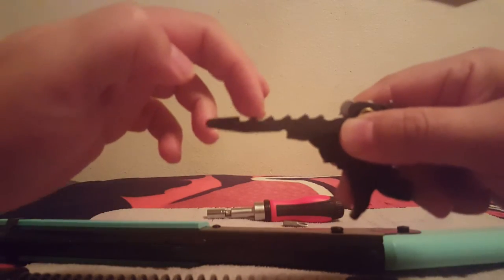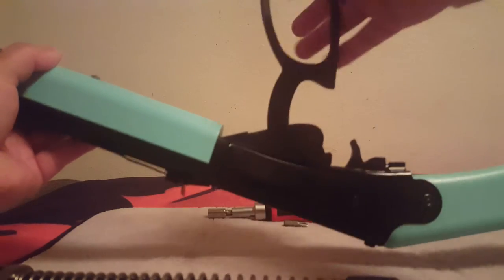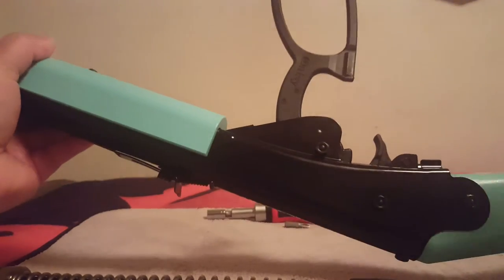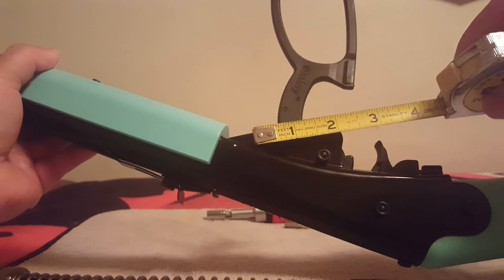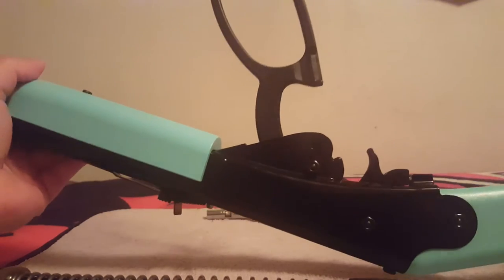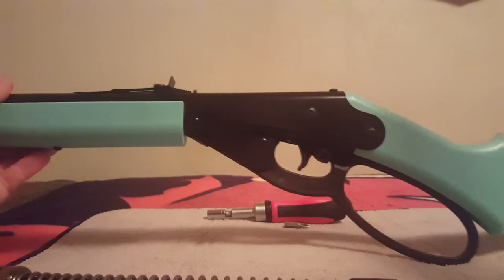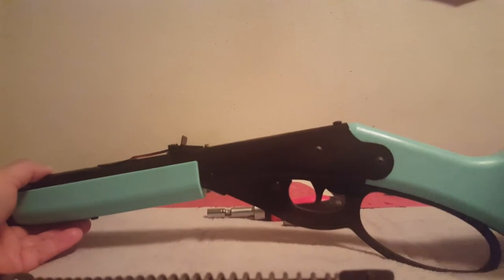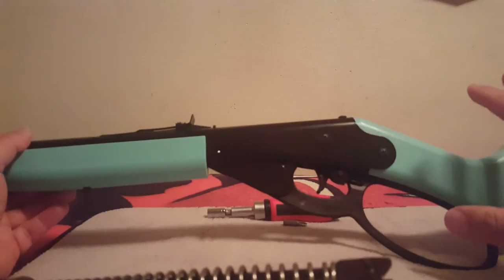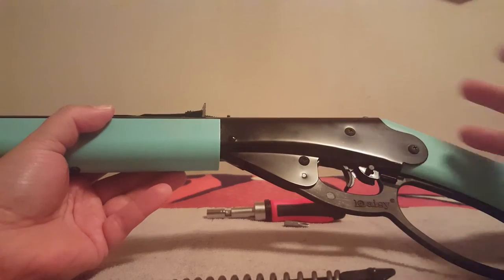One more click — that would be six, on the very back of that tooth. The measurement there is about five-eighths of an inch, still not all the way up. When it's all the way up it's three-eighths of an inch, and that's the sweet spot — it really jumps forward to three-eighths of an inch. Gun fixed. This is a big way people lose their Red Riders: they don't cock it right, think it's jammed, try taking out that screw, and that's it.